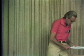But not in all the respects, because of these new pictures. I would like just to finish this off, though, to say that there's quite a considerable amount of things that you have to think about if you try to make machines smaller, because it isn't merely a matter, like you say, of making the same thing smaller. You take an electric motor and make every part smaller, it won't work. Various things come out in different proportions, you see, like the weight and the strength and the air resistance and everything. Ordinary things like electrical resistance on another scale are enormously too high relative and make a serious problem.